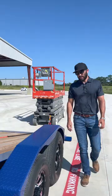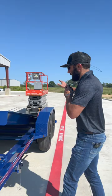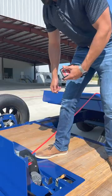Our bed is locked out, everything's pulled up, and now we have our wireless control. All of the Warrior winches come with a wireless control — makes it nice because you can be back around your equipment rather than right on top of it. We had put the clutch to out so we could pull the slack easily; now we've got to turn it back to in so that it will pull under pressure.